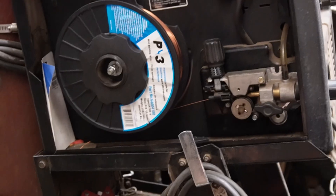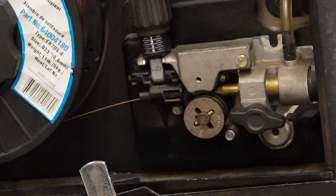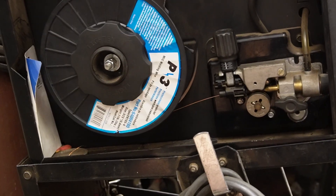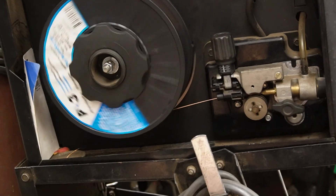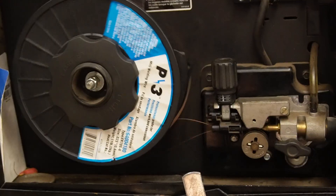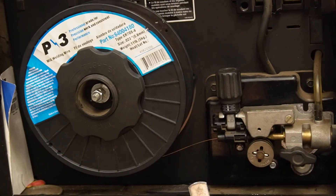Stretch out the lead so there are no tight bends, so the wire can travel freely. Turn on the machine with tension set all the way down — you'll see the drive roller spinning but the wire not feeding consistently. That means you need to crank up the tension. Keep pressing the trigger on and off, watching for slipping, adjusting up a little bit at a time until there's no delay in feeding. When your roll tension and wire tension are right, everything moves together with no feeding delay and no coasting.